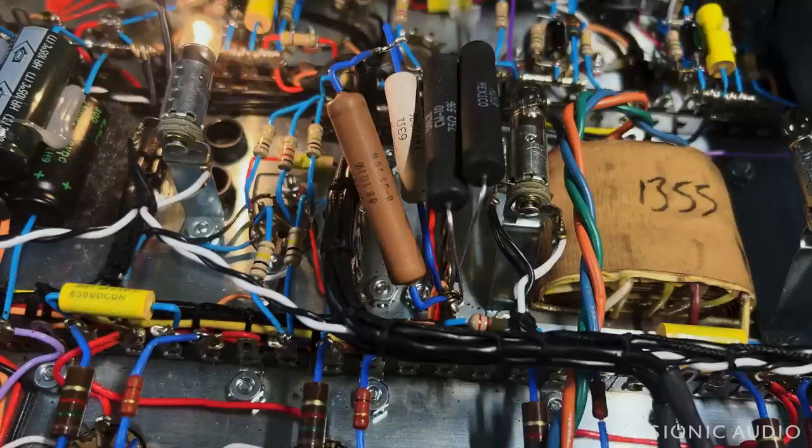If you're really chasing the ultimate tone and you don't mind having to change tubes a lot, then Phil's approach is fine. The amp will run extremely hot, the plastics will warp on the back panel, and tubes won't last — but some people perceive that as a certain sound worth the tradeoff. The owner of this amp plays in church at low power mode, and he didn't even realize his amp was crippled by bad hum from bad preamp tubes when it first came in. He's not the kind of player who wants to change tubes every six months.